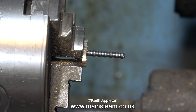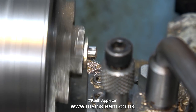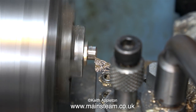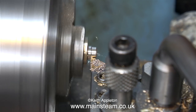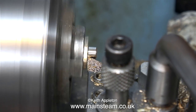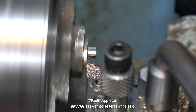I cut the head off a long 4BA bolt, and I'm using what's left of the bolt to allow me to clamp the brass part in the chuck, so I can turn it round the other way for the final cutting of the other side to the correct diameter. This fitting is one of the main focal points on the boiler backhead, so it's really important that the bolts that hold it to the backhead are equidistant from the outside edge of the flange to the centre part of the flange that sticks out. I'm also machining across the front, just to make sure everything sits perfectly flat.